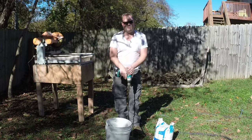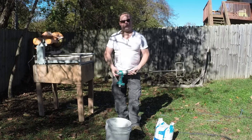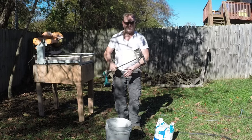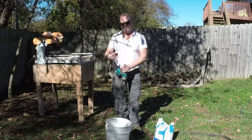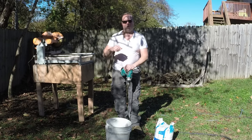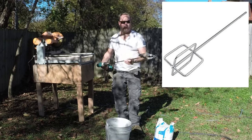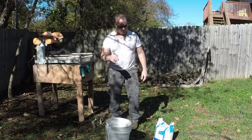You're going to need a five-gallon bucket and a beater on a drill. A lot of people have a nice cordless drill, but it's probably not heavy-duty enough. This big mortar paddle is a large mixer — it takes a heavy-duty drill to turn it without burning the motor up. If you just have a regular drill, you might be better off with a wire paint mixer, which has less resistance. It will still mix the mortar, but this big paddle really pushes and mixes mortar great — if you have the right drill to go with it.